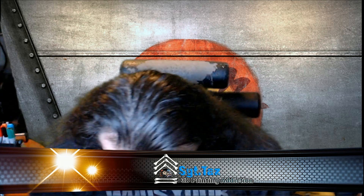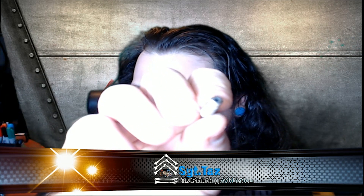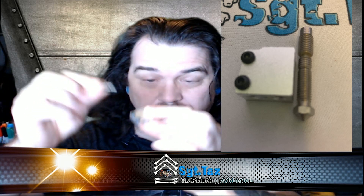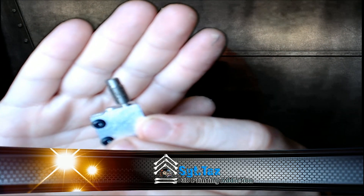So you take your block like so. Here's your all-metal hotend. It's hard to see, but you can see there's just a short, shallow little section of tubing that has to go in there, and then your hotend is actually touching. The bottom portion of it is going to be flush up against your nozzle inside the block. So what you want to do to start off is put your all-metal into your heat block.